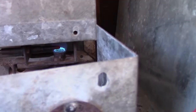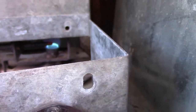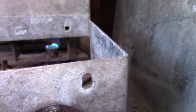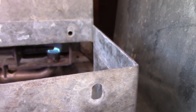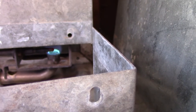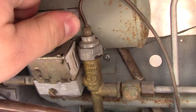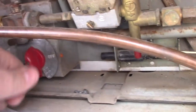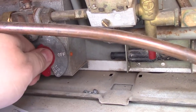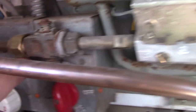This is your warmer/cooler dial. If I adjust that you'll notice the flame will go down — it almost goes out. So you want to make sure that's up enough, all the way to cold. This one down here is for when you're on electric. And this is how you switch from electric to 12-volt to propane. You also want to make sure this is all the way on, because if you turn this it will make the flame go out as well.